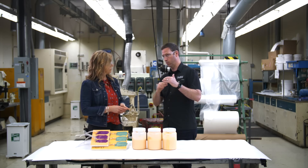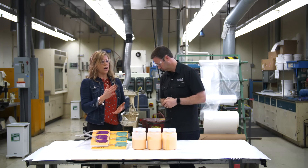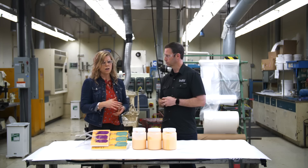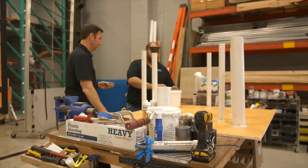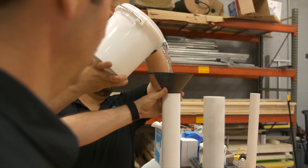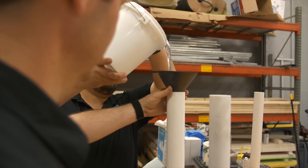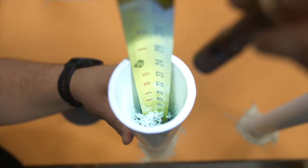Number two is the hydrostatic head test. In the nail sealability test you're already putting a hydrostatic head on there. This test isolates the surface area and you go 55 centimeters — typically tested as a free film so you can visually see if water makes its way through. In our case, we've applied our membrane onto sheathing, so to detect if water is making its way through we put dye into the water and then look at it under blacklight. It did not pass through. We're taking it one step further to make sure there has been no absorption at all into the board.